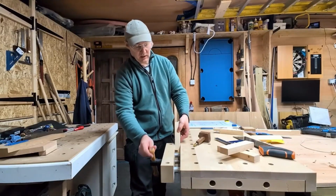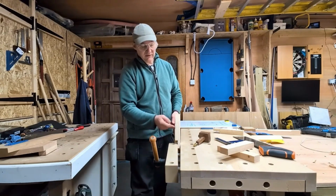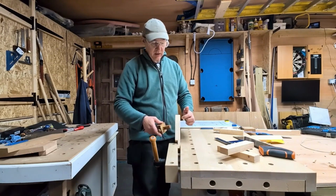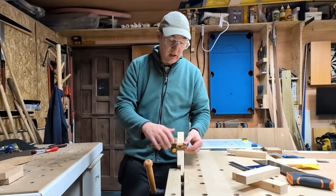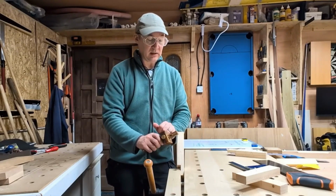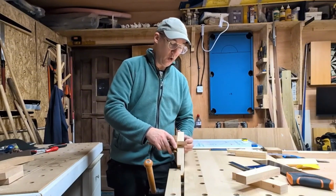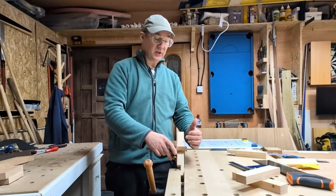Take your timber. Face out. The block must go against the face. When we're marking this up, I'm going to put a small dent near that end line. So when I run into that dent, it'll stop. Now, starting this, the focus is not the pin. The focus is that the block here is against the face. So even if I don't actually have the pin on it and I want to run that through there, I want to do that so that there's no gap forming here. Once you can put that pressure on there and keep doing that, that's the primary aim.